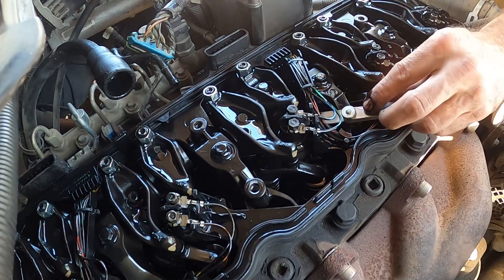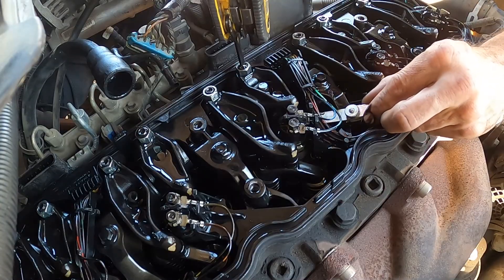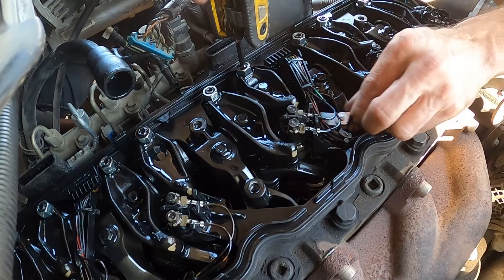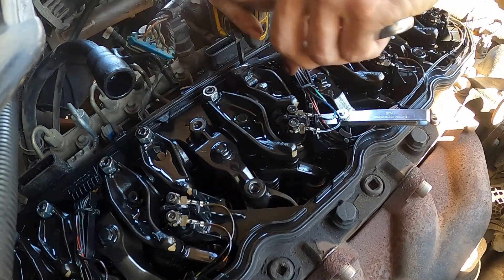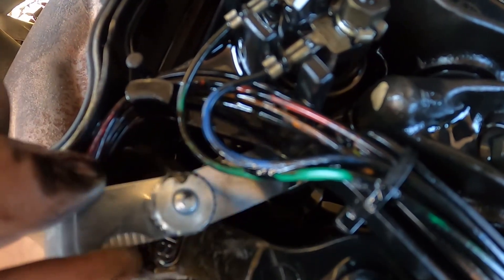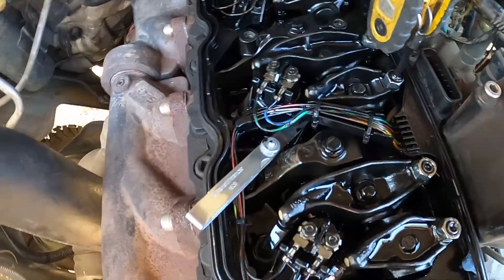It's got a lot of play in it right now. We're going to adjust the 6mm hex until there's drag on the feeler gauge. You don't want it to be smooth and you don't want it to be impossible to move — you just want some drag. About there is good. Now tighten the lock nut with the 14mm wrench and recheck to make sure the adjustment didn't move. Think of the drag like dragging your finger along a smooth table — that's what I mean.